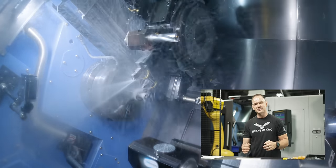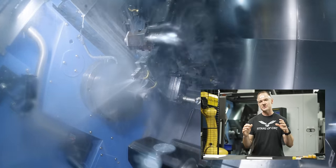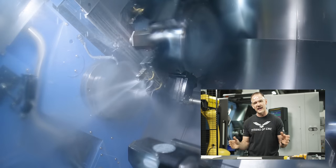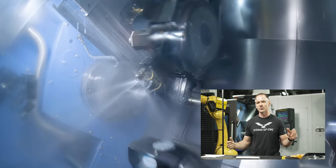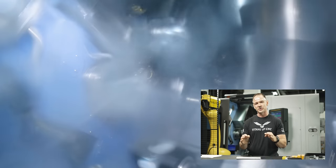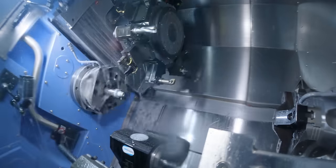Now, what characterizes the superalloys is a couple things. One is their high strength, especially under those high temp conditions, which is really a throwback to the aerospace heyday when they were first invented. They also have extreme resistance to environmental corrosion and oxidation, as well as creep and fatigue resistance and surface stability. All that is to say, these materials hold up.